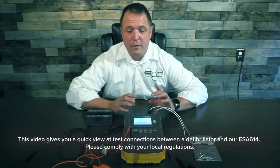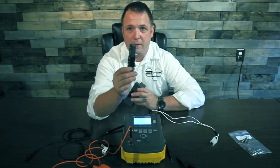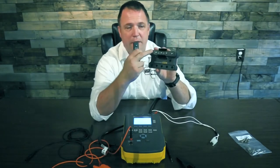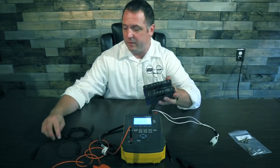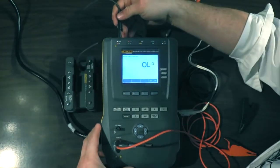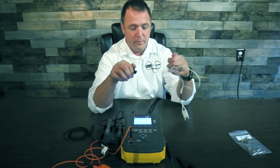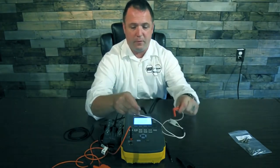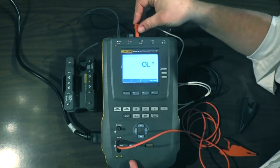Hello, everybody. I'm Justin Ross, and I'm back with our next video on how to connect a 5-lead or 12-lead ECG defibrillator to our ESA 612, 614, and 615 — and we're going to introduce the 1-to-10 adapter. Your 612 or 615 comes with one snap-to-banana pin adapter; when you buy the 1-to-10 adapter, you get a second one. We can connect up to 12 leads with snap-to-banana pins to the ESA at once. I'll take my cable and plug it into the first port, and then set up the hands-free adapter — I'm done with my discharge test on the Impulse 7000.